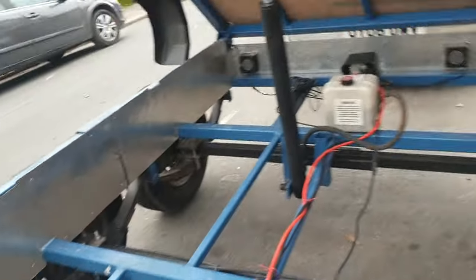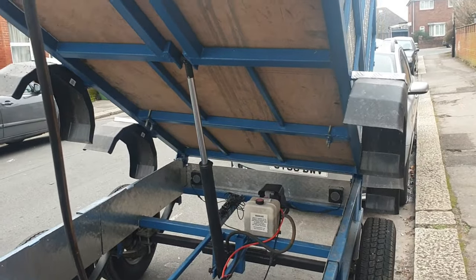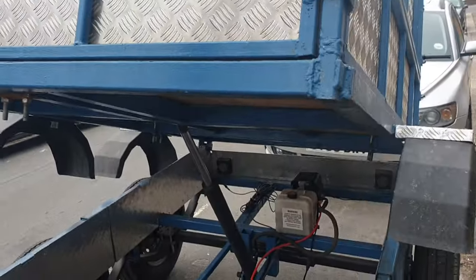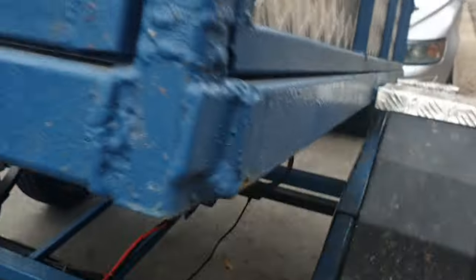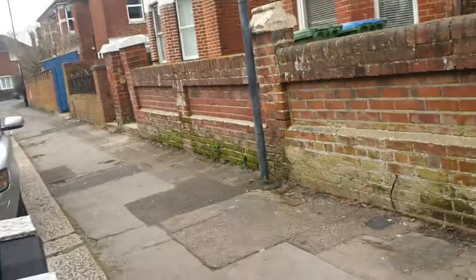It's a tipper trailer. I built it from scratch, and I built it all by hand, and I trust it, because I built it. It's not from a factory. I ain't got no lathes. I ain't got no machinery to cut all the metal. I've done it all with an angle grinder. The weld's all good. It's all bolted there. The crane's bolted down, so you can take the crane off if you had to. You can also take the sides off, so you can turn it into a flatbed like a truck, top and bottom. The pillars are fully welded, so you can't take them out. You just have to work around the pillars. And that is the way it is.